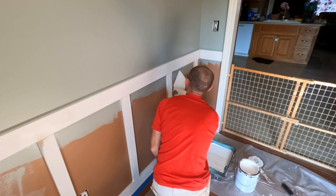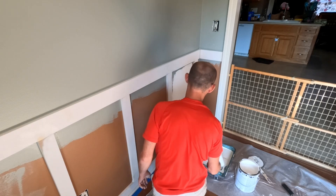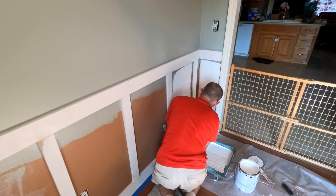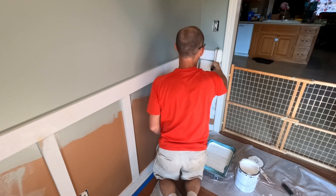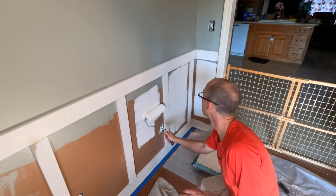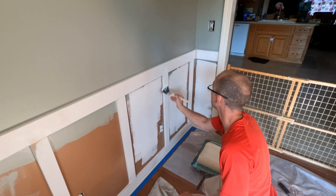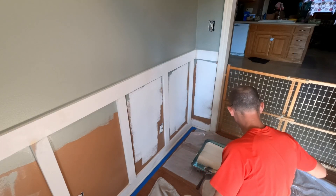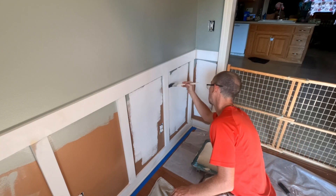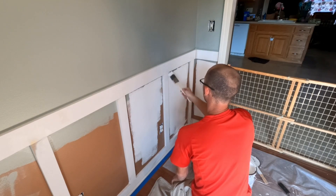I finally got everything sanded and cleaned up. It's important that you vacuum up all the dust and wipe everything down with a damp rag, especially if you spent time sanding right over the surface you're getting ready to paint. I originally painted this bottom section with a trim paint. My thought was that if the bottom is going to be married into all of the door casings, it just makes sense that all the paint matches. But this was a big mistake. If you're not familiar with sheens in paint, most walls are going to be a satin, eggshell, or flat, and a lot of people use semi-gloss for the trim. This paint is a semi-gloss, and I think I had something wrong with this particular batch because it did not lay well.